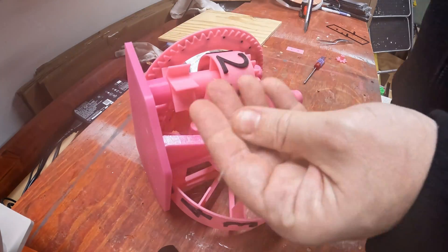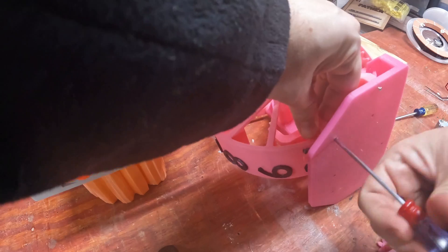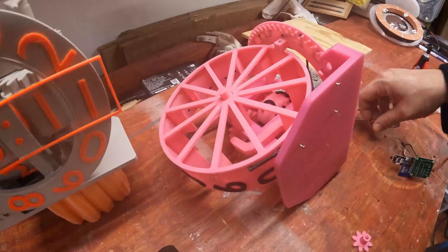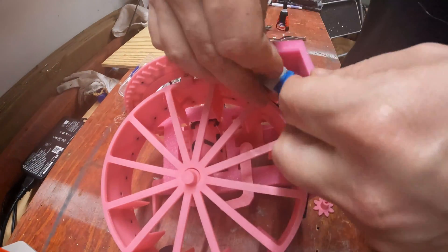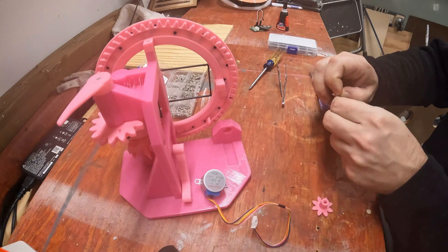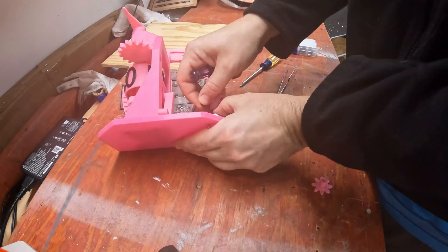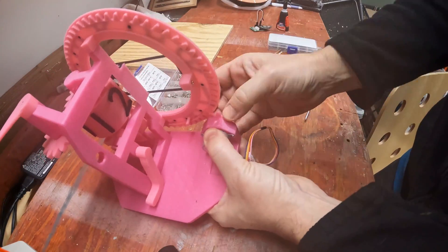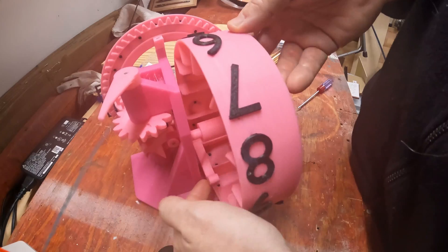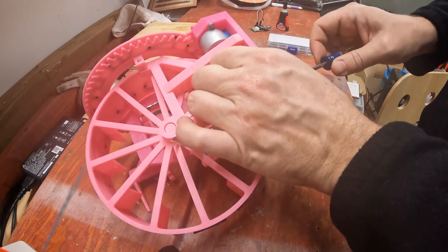Only a 2mm screw, but I'm still kind of impressed that I was able to snap the head right off. The motor is installed before the hour wheel and it's installed with two screws. I did need to find a couple of 2mm washers because the motor lugs are too big for the 2mm screws. The drive gear simply press fits onto the motor — it hasn't caused any problems and it's actually captured by the wheel itself, so I don't expect it to work its way loose even over a long duration operation. The last thing to go on is the hour wheel. It pops right into the slot there and is supported by the rightmost bracket. You also need to secure the front faceplate to the bracket that fully locks it in place, and then it'll screw to the base with three screws.